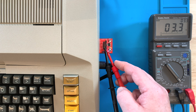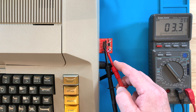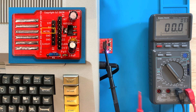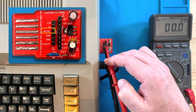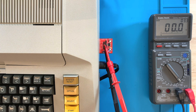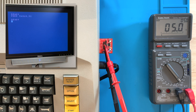The Atari is not going to have a lot of power to drive servo controllers, motors, and so forth. But if you're just trying to drive the board and do something — maybe create a MIDI interface with the Arduino or whatnot — that should work. The last thing I want to check is the motor control, because that's a fun output on the SIO port. It's right down here below the 5 volt. That's currently off. It drives 5 volts out of there, and then you can run a relay, maybe an LED — you don't want to draw too much power. But you do have direct control through a POKE command in BASIC and any other programming language. If we POKE 54018 and put 52 in there, it activates the motor control line on the SIO port. You can see we now have 5 volts on there.